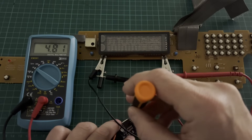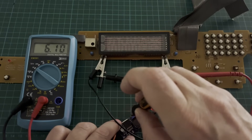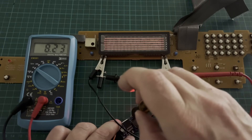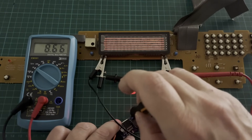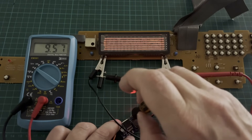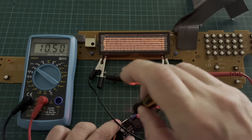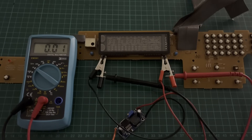There's already a faint glow. At 5 volts, then 6 volts, the glow is already visible. We continue to increase it — you can safely increase it to 9 volts, nothing will happen. At 9 volts we can already see a bright orange glow. We'll increase the voltage to 10.5 volts and leave it in that state for 10 to 15 seconds. 15 seconds have passed. We can turn it off now. Now let's put everything back together and check the result.